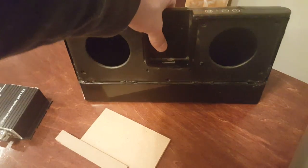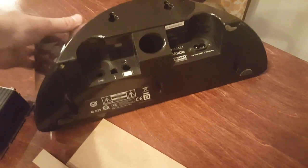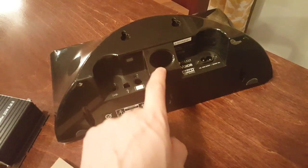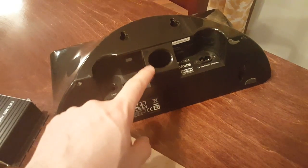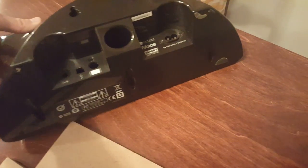I'm going to show you what a port looks like, because this speaker actually had a port on it. Right there at the bottom of the box is a port. That goes all the way into the enclosure — that one goes about three inches in — and that tunes it to a certain frequency, so it'll actually get a little lower frequency than a typical speaker.